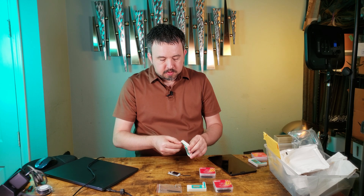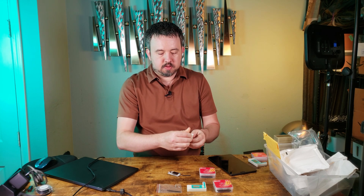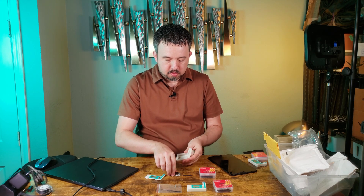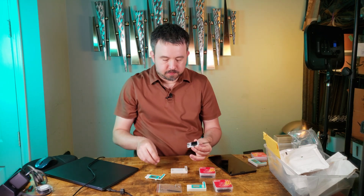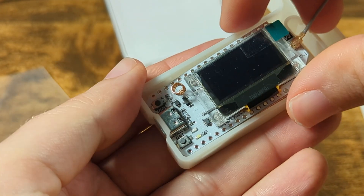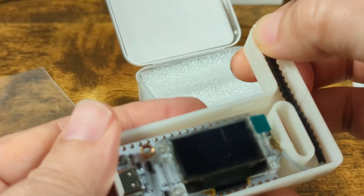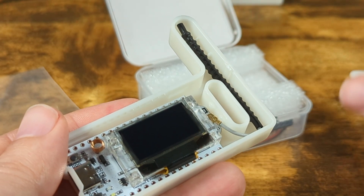With the antenna on, we can open up this case. I find it easy to go to the antenna side of this case. You can get a little bit of your fingernails in there or use a screwdriver to open it from this side — it should just snap off. You're going to want to line up the USB-C ports with the USB-C opening on the case, and it should pretty much fall into place. You'll need to rotate the antenna to go down, then rotate the wire around the bottom of the case, press the antenna into place, and put the top cover on.